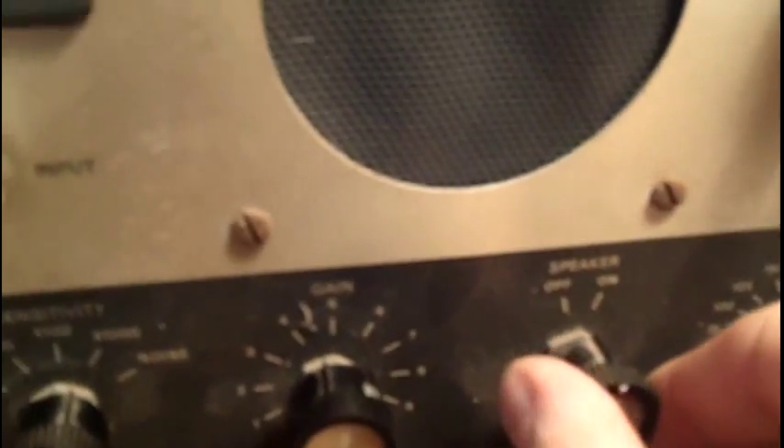You can also turn the speaker off. Now I'll turn it back up. So now you can see the signal actually going through just the eye tube. If you were doing some signal tracing and you didn't want to have your ears explode, you can always do this. The eye tube was also used for determining watts — you just plug a device in there and run it and see how many watts it uses.